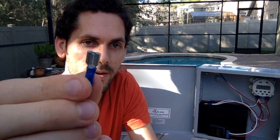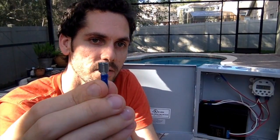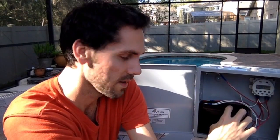In order to connect the rest of the circuit together I had to use terminal ends. You strip the wire, put these on, and crimp them using a wire stripper and crimper. These little pieces allow you to connect your wire to the terminal connection pieces on the timer switch, battery, and so on.